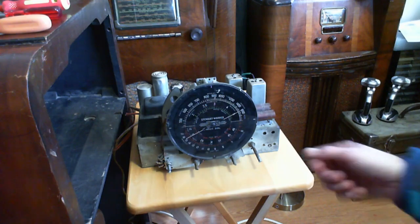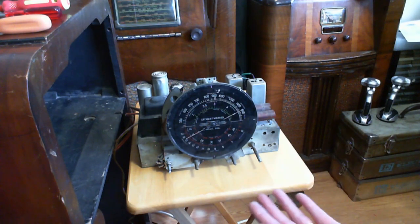If you plug back and forth and you're getting 20 volts and 100 volts, I'd be a little cautious about that situation myself, and I think that's what's happening here. So I'm going to change the capacitor and be done with it.